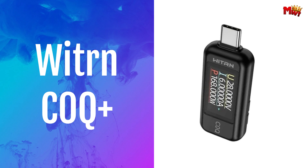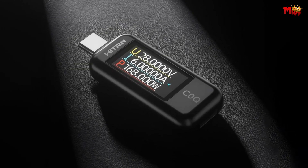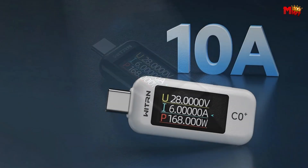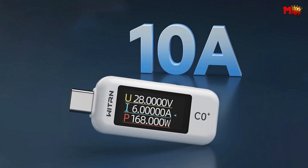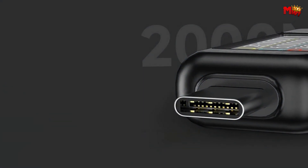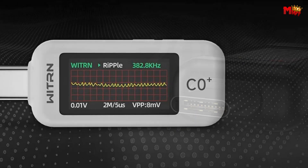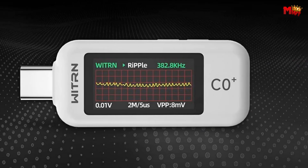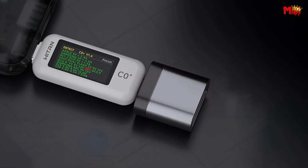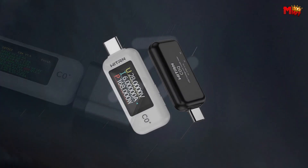Number 2: Warency ZeroQ Plus Type-C Voltage Tester. Engineered with precision and versatility, this device boasts a 24-pin full-pin pass-through interface compatible with USB4 and Thunderbolt 4, ensuring seamless connectivity and blazing fast data transmission speeds exceeding 2,000 Mbps. Equipped with a 2MHz high-speed ripple measurement capability, the ZeroQ Plus features a triple-function curve display showcasing detailed charging head performance metrics including working frequency and efficiency.